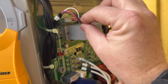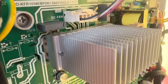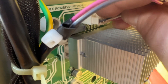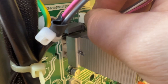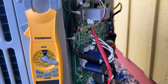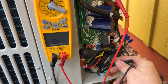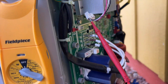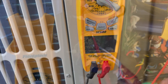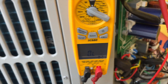It looks like it's a three-phase DC motor. This connector comes off first — that's the lock — then you push down and pull it out. So we're checking this just like a three-phase motor. Doing black wire to ground — nothing. White to ground — nothing. Red to ground — nothing. So it's not grounding.